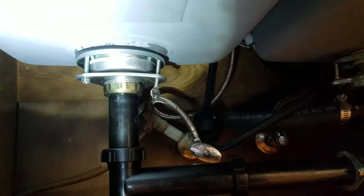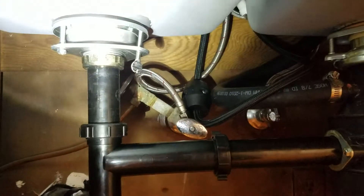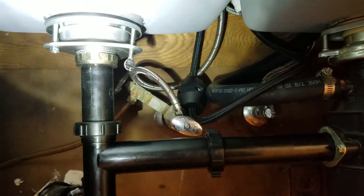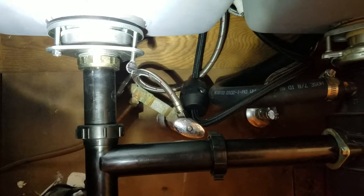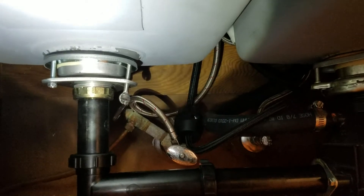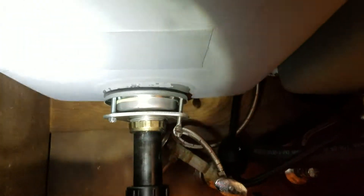The basket strainer we got straight out of Home Depot. One of the bolts right there you can see is shorter and it's not a thumb screw — for some reason that didn't work right, so we got one off our truck and put it in there just to mount it correctly. So the basket strainer we provided, got it puttied in, and we ran lots of water down it so there's no leaking.